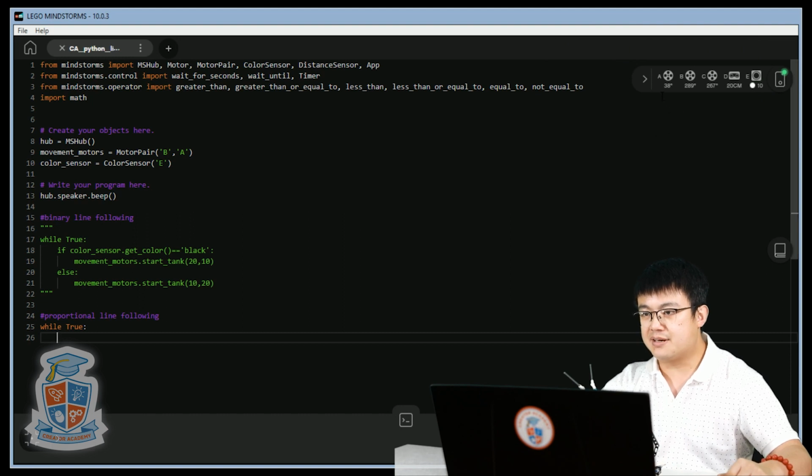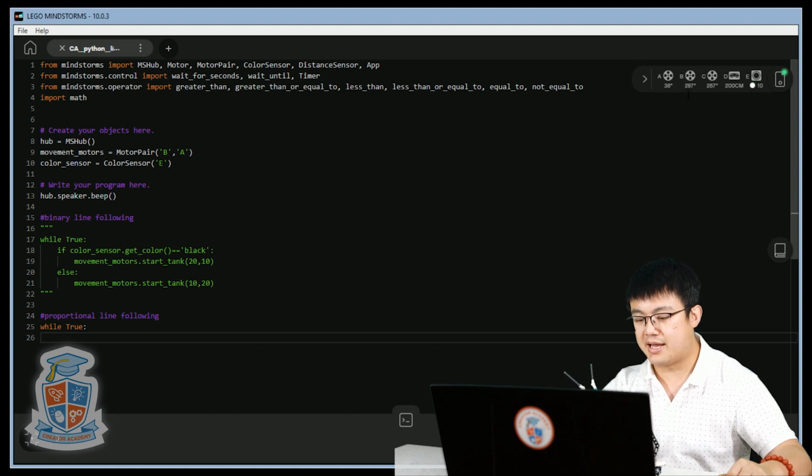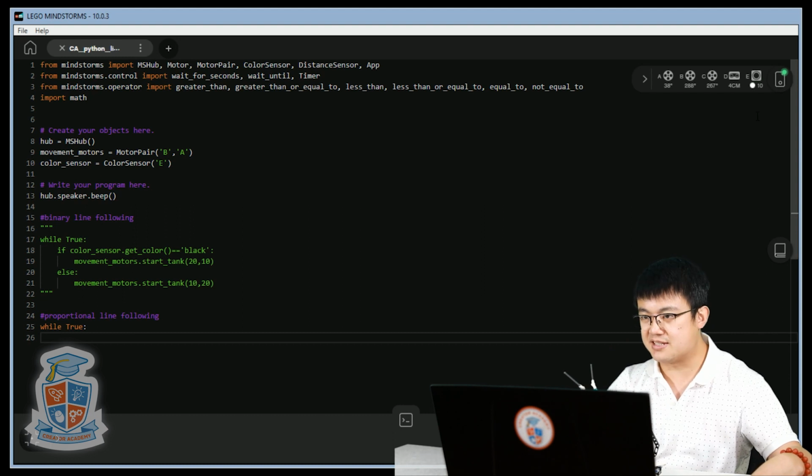You see how there are all of our port readings on the top right. All right, we got A, B, C, and D. A, B, and C are all motors. You can see what their rotation degrees are already. D is our distance sensor, which is detecting a distance and changes when I move my hand in front of it. But then we have E here, which is our color sensor. And you can see it's detecting white at the moment. If I move the robot into the black line, it detects black. See, white, black, white, black.